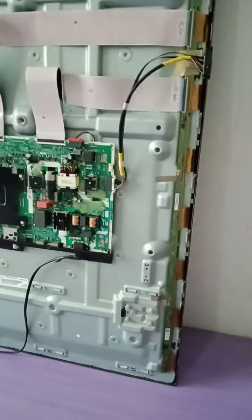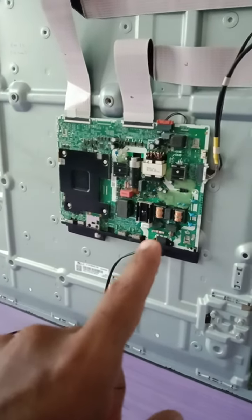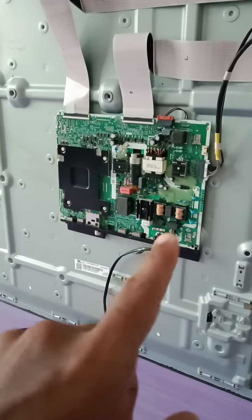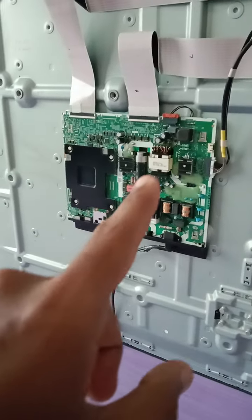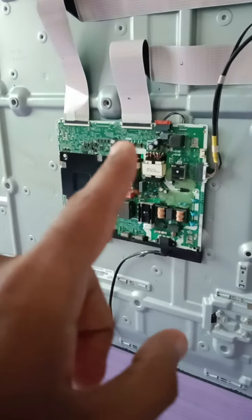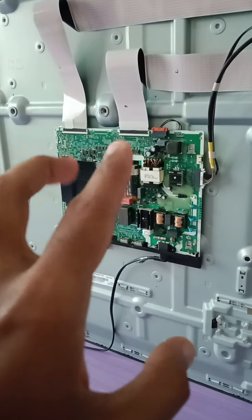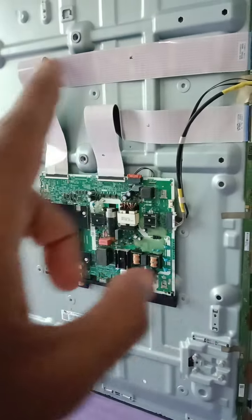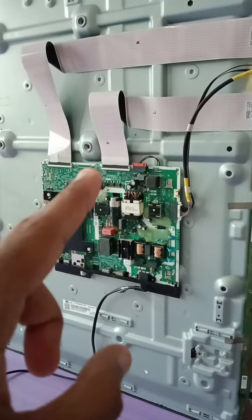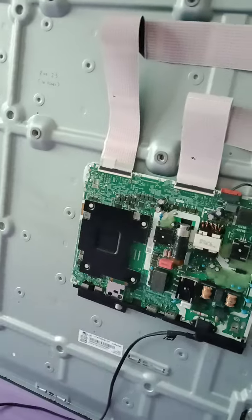So for this TV, it's using one single board. It's an AIO, all in one. So here's the power supply, here's the primary side. And then from this transformer, secondary. So got the backlight, this one goes to control, and then the LCD is divided into two, which is left and right. Then the TCON section is here. There's a VGH point, processor, so everything is here.